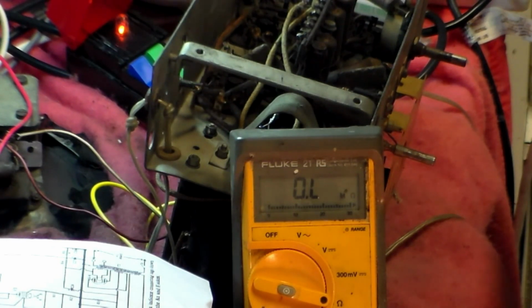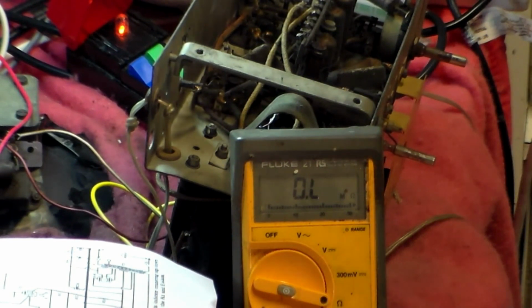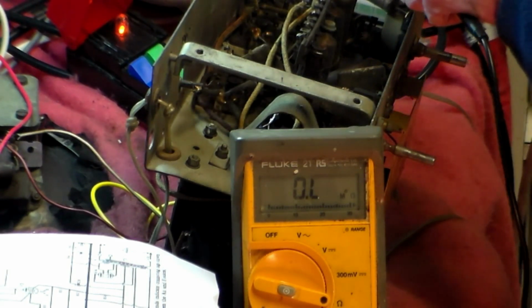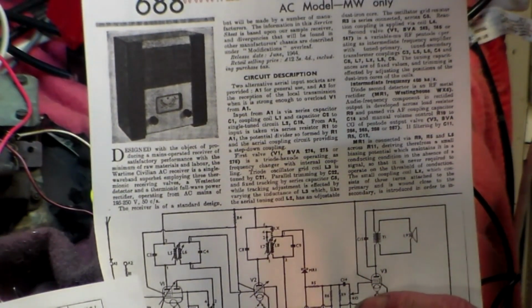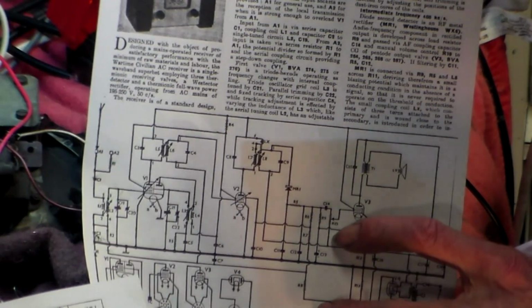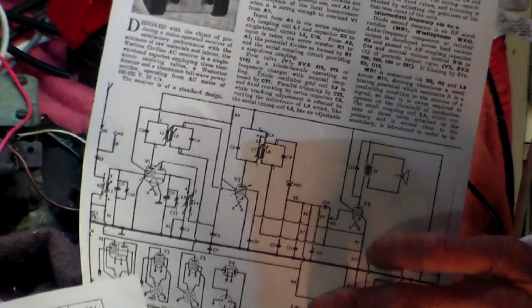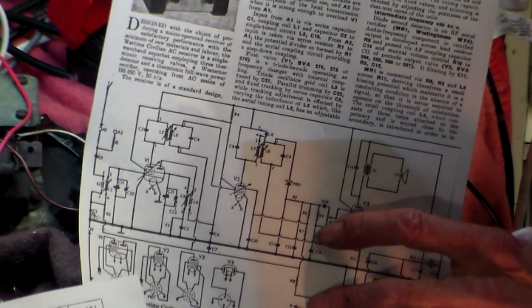Now, connected to the other end of that wire should be R9, which is the load resistor for the detector diode, which again is doing something, otherwise we wouldn't get anything. So therefore, if we look there for the volume control, again because of the circuit here, you see, the volume control is there. Yeah, you see it? It's there. Now from there goes to C14, and of course also goes to R9.